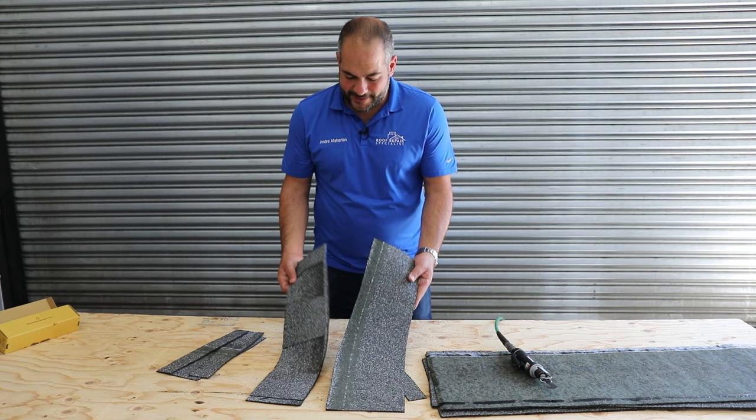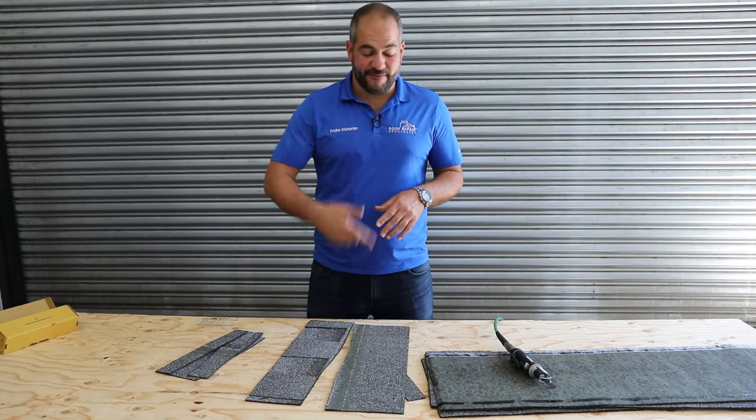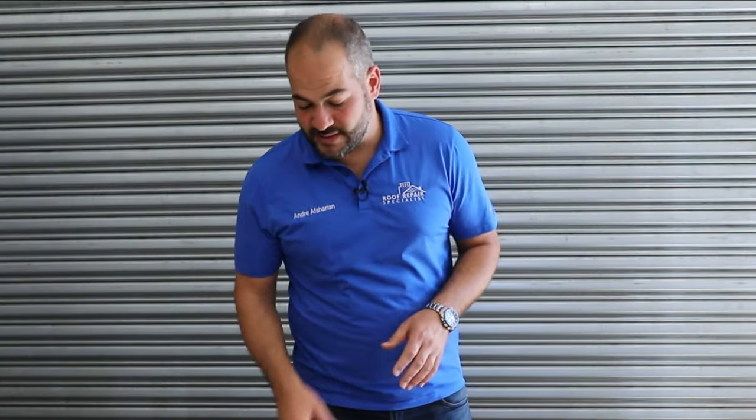What I'm going to try is actually going down the nail zone, which is the thickest part of the shingle, and seeing if I can get all the way through. So it definitely cut this like butter — no ifs, ands, or buts about it. One thing I realize is we have a small pancake compressor running, and that probably won't be enough air to have this running over and over. After like two or three cuts, the compressor starts going. So if you're cutting through a bunch of shingles or cutting down a valley — say 20 or 30 feet — you probably won't be able to get through it with a small compressor. If you're using a larger gas-powered compressor, that definitely won't be a problem. Air volume is definitely something to consider when buying this tool.